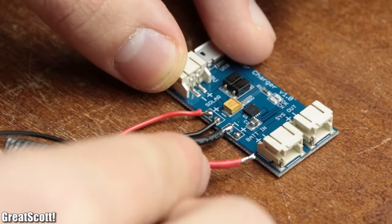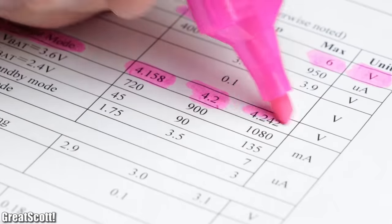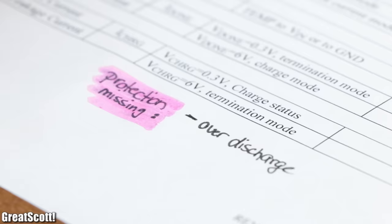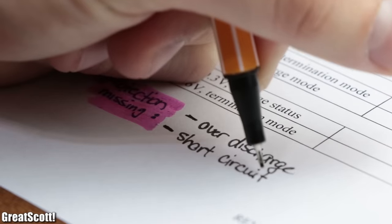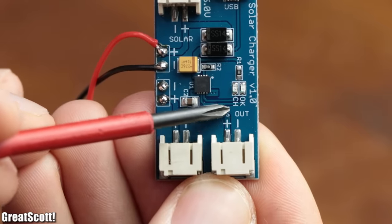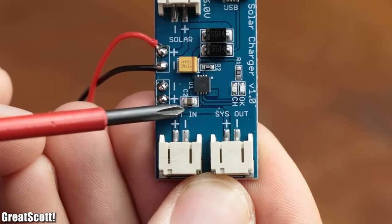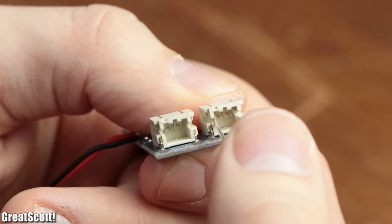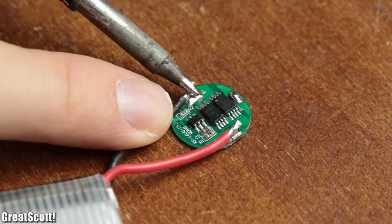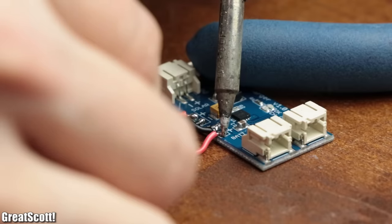Next it was time to find a test battery, which ultimately turned out to be a 1200 mAh LiPo battery. But right before I was done soldering it to the PCB I realized that the solar charger IC only features an over voltage protection during charging but misses an over discharge protection and more importantly a short circuit protection. This is especially important since the battery voltage is simply bridged over to the SYS-OUT JST connector, which means we could easily short the battery if we make a mistake. So to protect the LiPo I added an additional protection circuit to it before hooking it up to the solar charger.